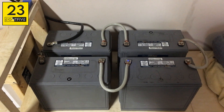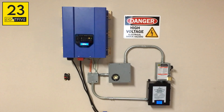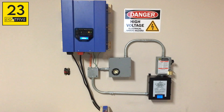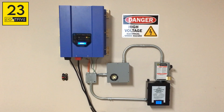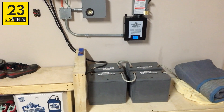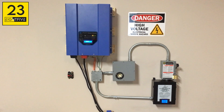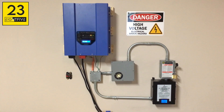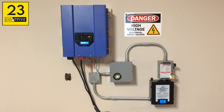I plan on getting another eight of these batteries. As of right now, the load test that I've done with this setup — I was able to run my house for seven hours, pulling approximately 26% load on this inverter, which works out to somewhere just under 2000 watts. The battery bank dropped down to approximately 47 volts during that period, so I could have probably run for an extended time. That included loads like the garage door opener, my refrigerator, and the heat. I have natural gas heat, so I can run the blower motor and have heat in the house while this is going on.